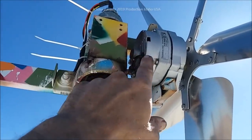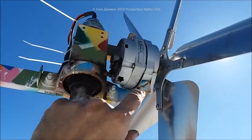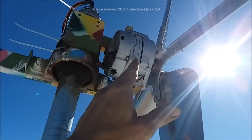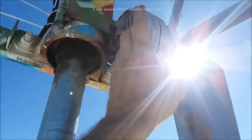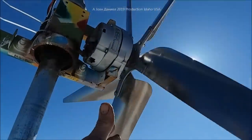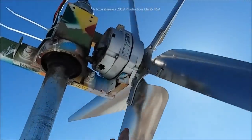Here's my secret — and there's somebody in the Midwest, probably going to freak out when they find out why this produces so much power. I took the 14 magnets out, water-cut the core inside, and replaced them with 12 magnets. So it doesn't cog at all — no cog — and it produces 700, 800, 900 watts. It's even hit 1,500 watts.